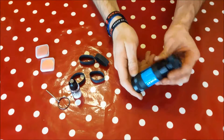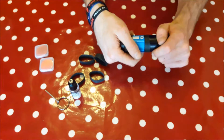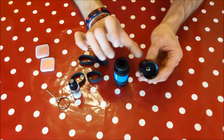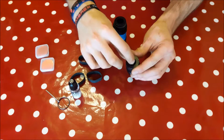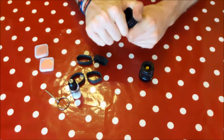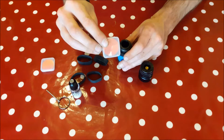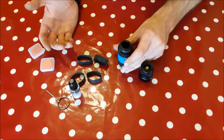The grenade itself is aluminium CNC'd. It works by filling this section up with green gas or propane, and then the pin inside the gas section is hit by the hammer, which is activated upon impact. It then pressurises against one of the films until the film can't handle the pressure anymore and it explodes — sort of like popping a plastic bag.